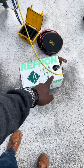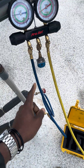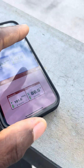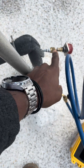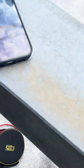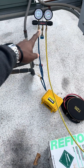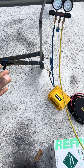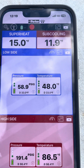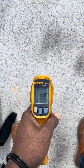Check out this setup - my charging hose going into the high side, which is currently closed so the tank is closed off, and the low side is open. My low side pressure comes up to my gauge and I get the sensor reading over here. I've got my sight glass sensor right on my liquid line with the clamps. This tool is awesome - it was very expensive. That one little 15-second squeeze: 14 degrees superheat, 15 superheat, 12 degrees subcooling, 48 degrees suction pipe. Let's go inside and make some temperature readings - it's 49 degrees outside.